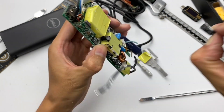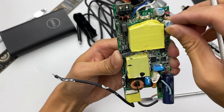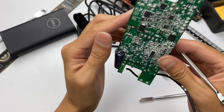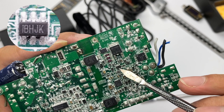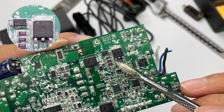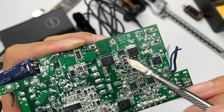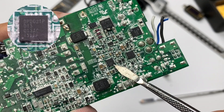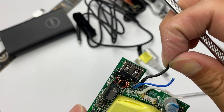Here is the main transformer of the switching power supply, with two optocouplers. This capacitor is 35V, 100μF. The synchronous rectification and output filtering circuit are on the right, consisting of two capacitors and one inductor. A small PCB is on the left, equipped with the step-down circuit for USB-A. Turning to the back, two Murata SMD-Y capacitors are between the primary and secondary circuits. The chip is the MPS synchronous rectifier controller, very common in GaN chargers, with a maximum operating frequency of 600kHz. Here is the Alpha and Omega synchronous rectification MOSFET with a breakdown voltage of 100V. The parallel diode on the left improves light-load efficiency. The Alpha and Omega output VBUS switch MOSFET is in the lower right corner. There are two protocol chips marked DP-D021P. Here is a 5A fuse at the output for overcurrent protection. The built-in cable has only three wires inside.